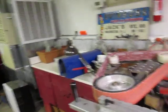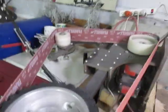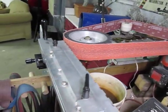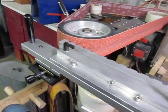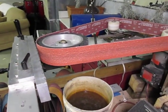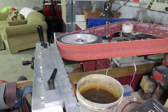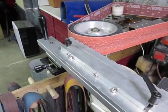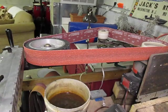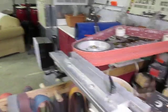So to get on with it, I'll turn the camera around and we'll look at the cool stuff. This is a 2x72 inch belt grinder. It tilts on its side — normally it's sitting upright, but right now I've got it tilted down to a horizontal position because I've got a surface grinding attachment mounted to it. A surface grinder is a machining tool with a lot more accuracy than this, but for knife making, its main purpose is making things flat.